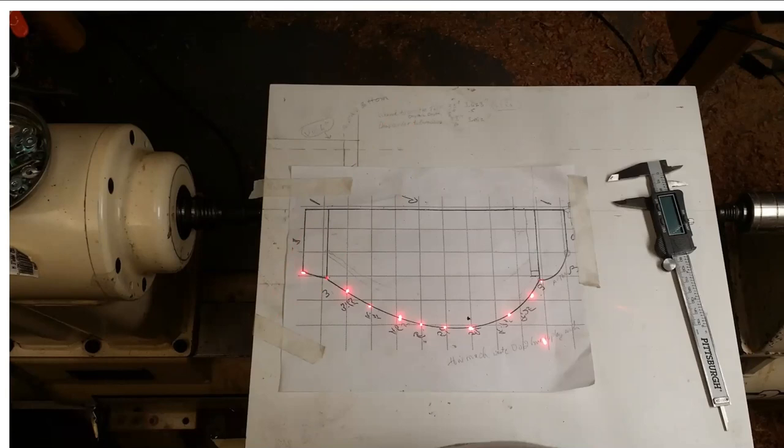Q: Could you duplicate the grid pattern on plywood, drill holes, insert lasers, and hold it above the workpiece? No — if you drill 12 six-millimeter holes and stick 12 lasers in, they won't follow the grid because they're all off. You'll have dots all over the place. Any variance is totally annoying because if one laser is displaced, you can't move that arm without it physically hitting the adjacent laser. They need to come straight out — that's why the ball method was necessary.